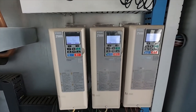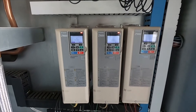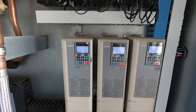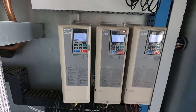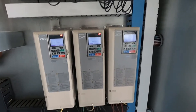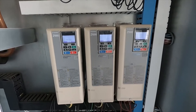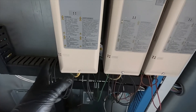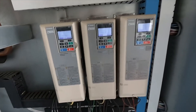I have a little bit of hands-on with Yaskawa and Danfoss, but I'm not a master. I've had people call me to help figure out what's going on with a drive — I can only do so much because I only know so much. You've got to have your manual ready so we can go through it, have the cover off so we can check visually, inspect the wiring, and make sure no dip switches are set a certain way.